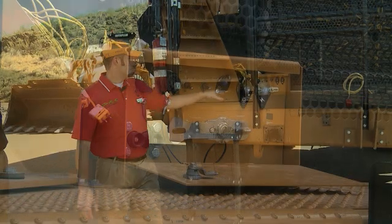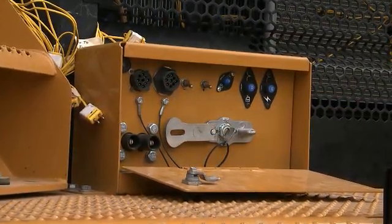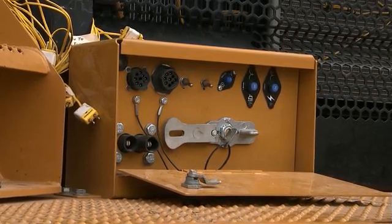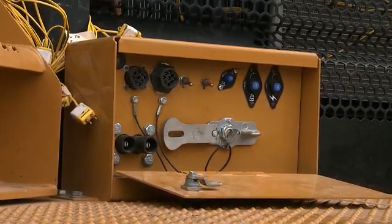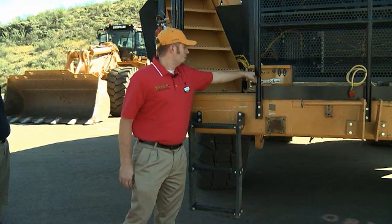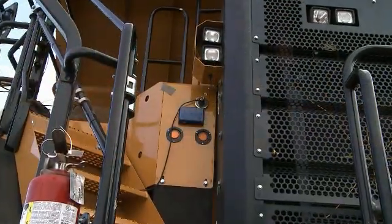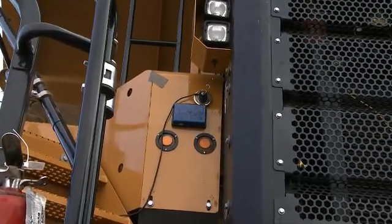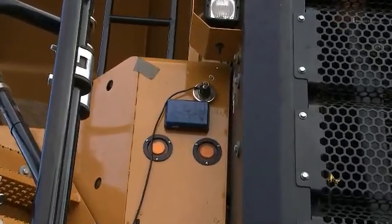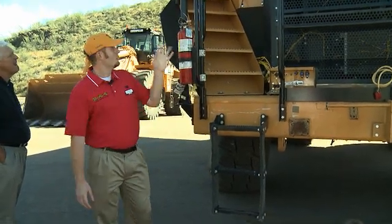This electrical box has a VIMS and an ET port. It has a machine lockout and a hydraulic lockout. There are some breakers in here, an auxiliary start receptacle, and an engine disconnect switch. The engine lockout and hydraulics lockout switches activate those lights up there, which tells you from afar if the machine is locked out or if the hydraulics are locked out. The blue light above that is a VIMS warning light — it tells a mine operator from ground level if there's a VIMS event going on in the cab.